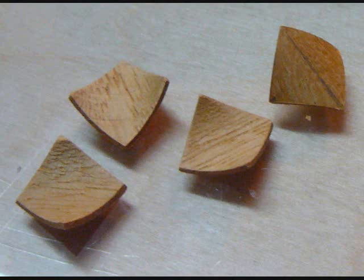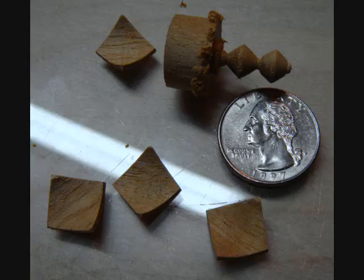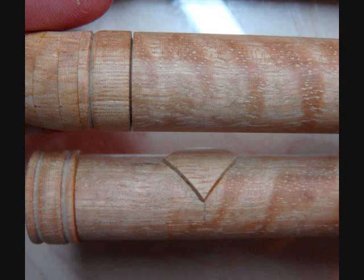and sand off the corners using the disc sander. Here I have turned the decorative pieces that go between the pads on one stub, so I can cut them off with a pair of wire cutters. These small parts can fly off out of your hand easily when sanding them with the Dremel. I dry fit them and make pencil marks where the corners are going to go. I make sure the pencil marks are far enough away from the corners so I can erase them after.